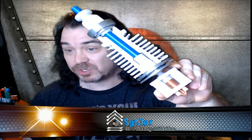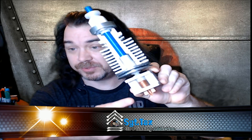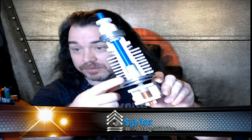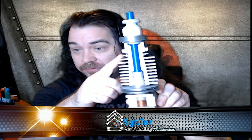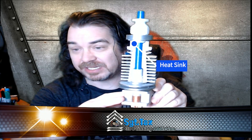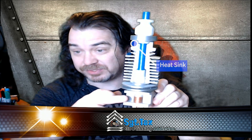What I'm going to go over today is more or less how to set one up. As you can see, I have a large model of a standard hotend — not the Volcano, but it works on the same premises. So you're going to have your nozzle, your heat break, and then obviously your cooling fins to keep the upper section cool as it's entering into the heat break to melt into the melting zone.